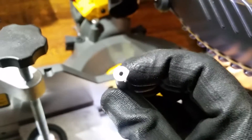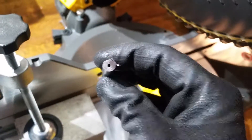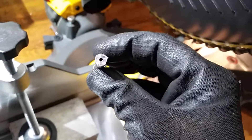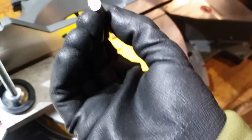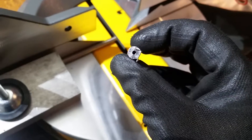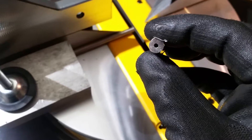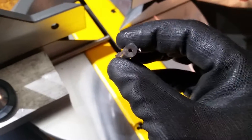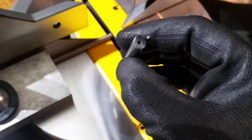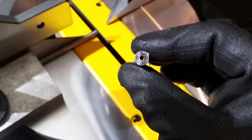This is a very special piece of titanium, made for medical applications — specifically bone screws, which is why it's got the hole in the middle. But they also work out awesome for making your own bolts even lighter if you don't need the bolt to seal anything. And also, drilling titanium is so much easier — or even doable — if you already have a small hole drilled.